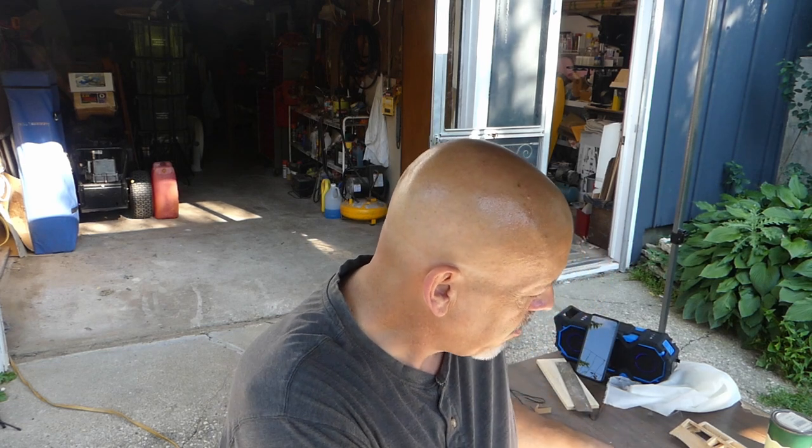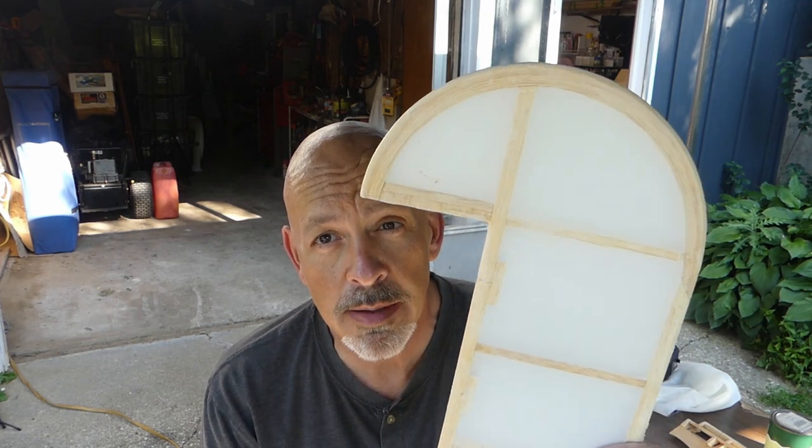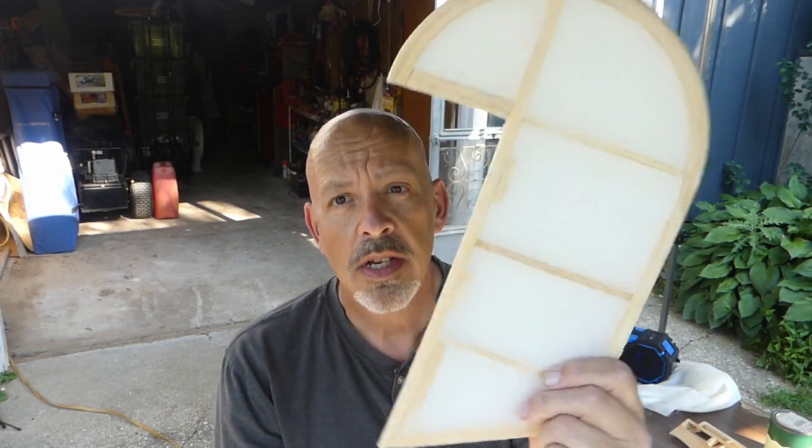Now, the three things that got taken care of today — and it was a battle. The one thing I did learn is don't deviate from the norm. I'm going back to the way I did it before, because trying to save time by putting the dope on the outside and letting it dry was a bigger pain than you could imagine — it took about three times as long to get the first one done. The second one I just went back to old school and had it banged out within an hour. So we've got two elevators, all covered with two coats of nitrate dope on them.